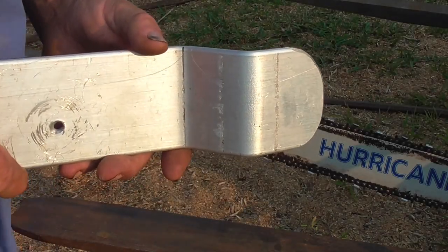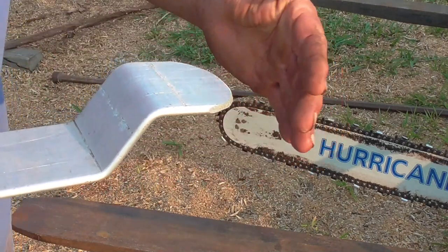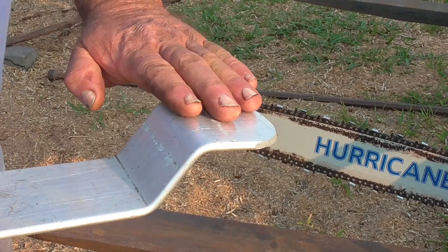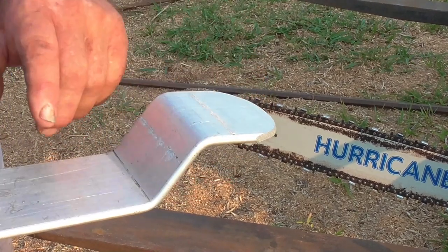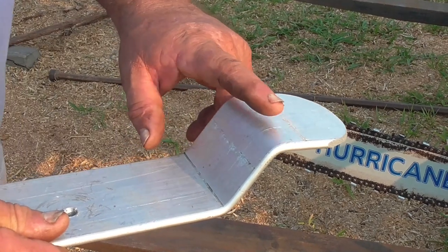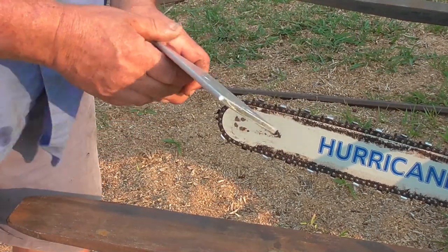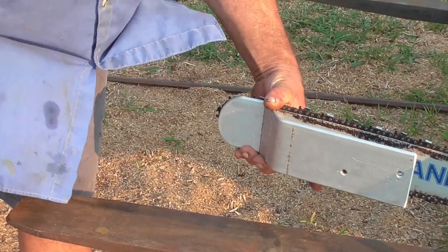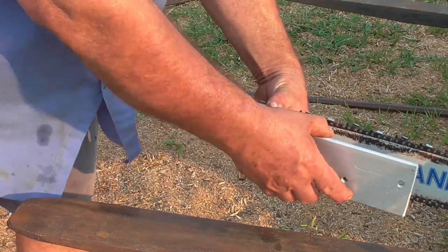These are the dogs I've made to hold the logs down. You can see they've got a step in them, and the round piece up front is what goes into the log. It's designed to be the same shape as the end of the chainsaw bar. If the blade comes along and touches or cuts into it, it won't destroy the tungsten on the blade. There's a good two inches difference in height between the mounting screws and where it goes into the log, so you'd have to do something absolutely crazy to hit the screws, which are high tensile and would wreck the blade. It works a little bit like a biscuit and a biscuit joiner, and it's been very successful for me.